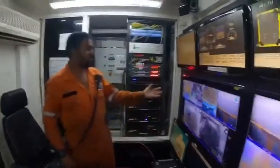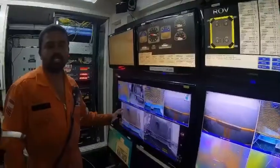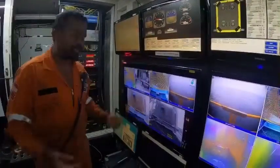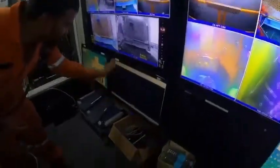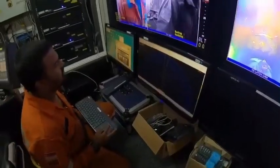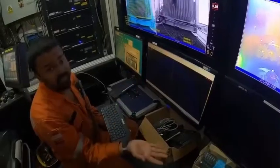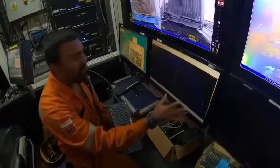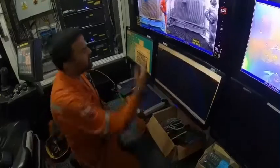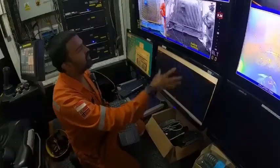If you look at the screen, this is the screen of the cameras that we have on the ROVs. These cameras are the eyes for the ROV — they're the only reference we use to fly the ROV around our job site. We also have sonar. Sonar is like what we have in submarines — it uses sound waves to give us a 2D image of any obstructions or objects in the sea before we can even see them. We have a range of up to 100 meters. We detect with sonar first, and as we go closer, then we have a real view on the camera.